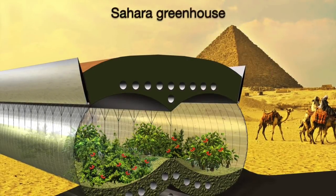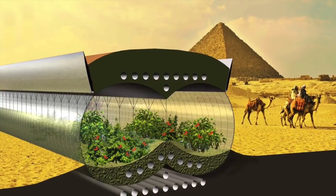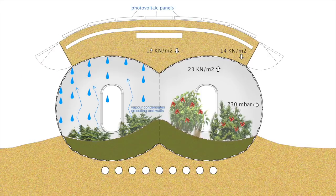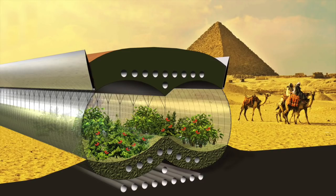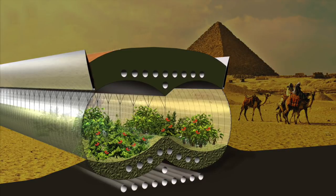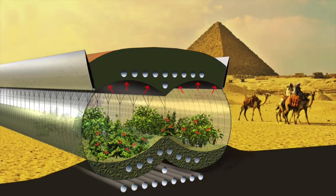Here is a derived application on Earth as a greenhouse in hot and dry climates. There is no loss of water in the closed space; water vaporizes during the day and condensates at night on the walls and ceiling, from where it flows back to the soil. The thick deposit of soil on the ceiling shields against strong sun radiation at high angle at noon. From the sides facing north and south, diffused light enters as well as the welcome sunlight from a low angle in winter. Pipes are guided through the ceiling and under the structure; at night, when the temperature considerably drops, cold air is blown through these pipes and cools the soil, so the cool mass of the soil absorbs heat from the interior space through its cool surface.